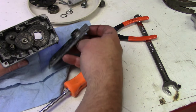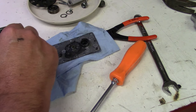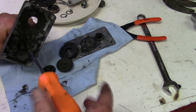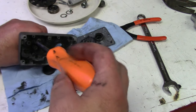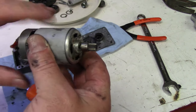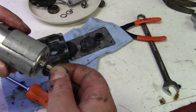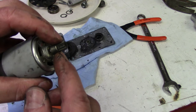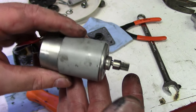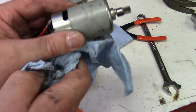This box should just come off. Look at all that nice yummy grease. We'll just take the gears out. Two Phillips screws holding that motor in — we'll just take those out. And there's our motor. It looks like the pinion is pressed on — that's a bugger. So that might be a showstopper if we can't get that pinion off. You can buy the motor with the gear on, but then you're going to be paying $50, $60, $70 — basically for a $10 motor and a $2 gear. But hopefully we can get that off.